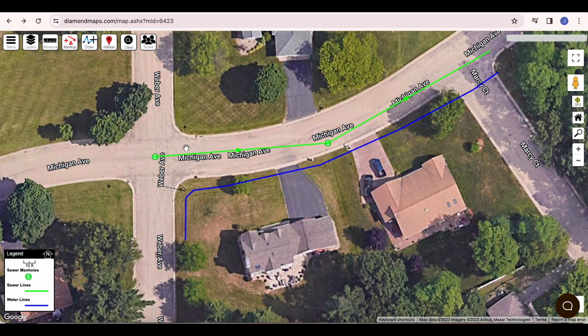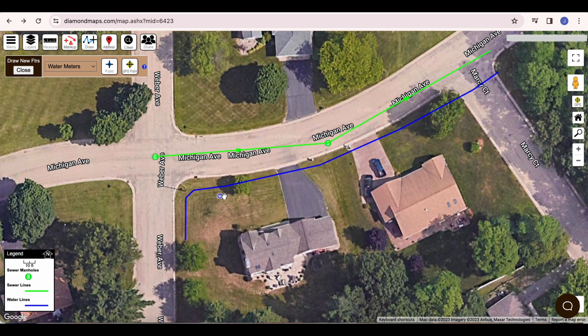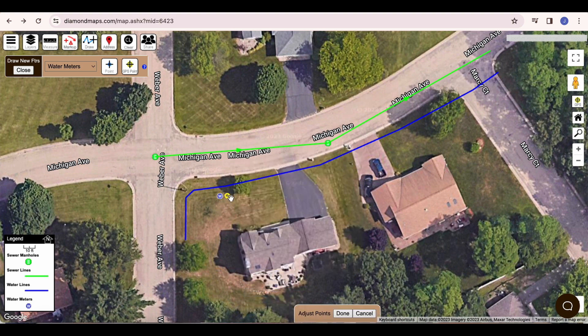Lastly, let's mark some water meter locations. If you have a spreadsheet listing the latitude and longitude coordinates for all your water meters, we can import those onto your map. But if you don't have that, you just click Draw, choose the water meters layer, click the Point button, and click on the map where the first meter goes. If you have a lot of landmarks such as sidewalks and trees, your meter reader can probably plot a couple hundred of these in one sitting with reasonable accuracy. The map automatically records the latitude and longitude coordinates of each meter as you click. If you want to move any point or line already drawn, choose Adjust Points on the action menu, drag the point to its correct location, and click Apply.